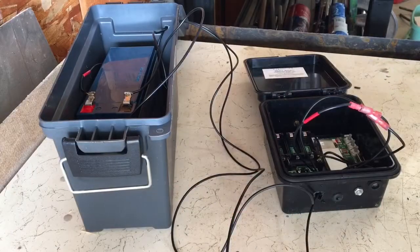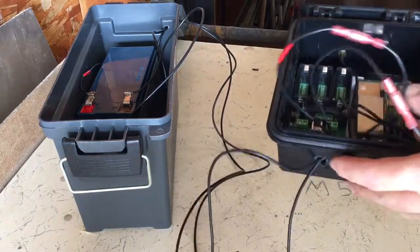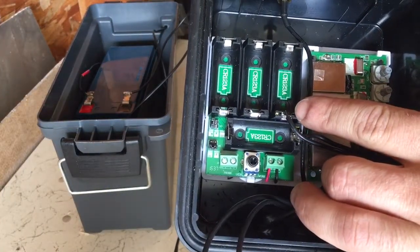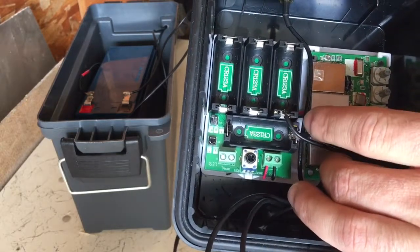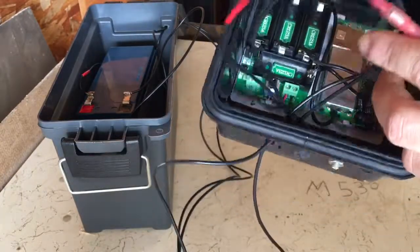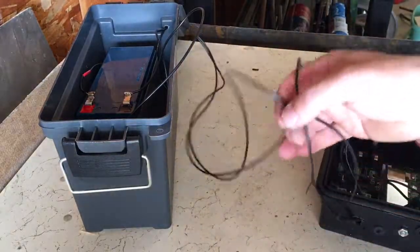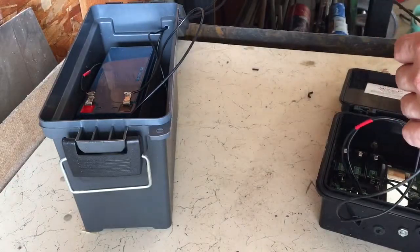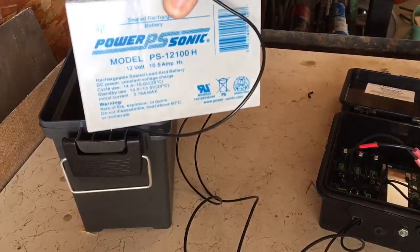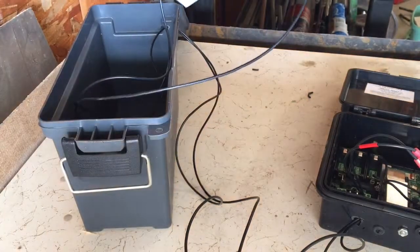Here's the completed system with the battery wired in to replace the lithium batteries. I've got wire soldered to the positive and another wire soldered to the negative, with a couple of bullet connectors and power wires coming out the bottom. Those run over to a cheap ammo can where I've got a 12-volt 10.5 amp-hour sealed lead-acid battery, which I'll be able to charge when it runs out.